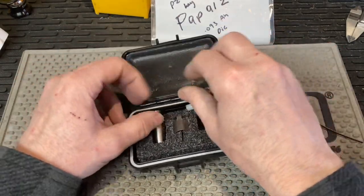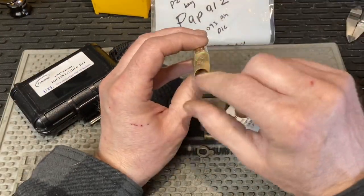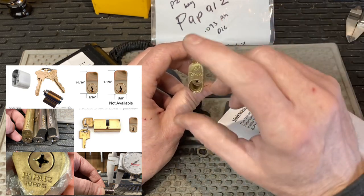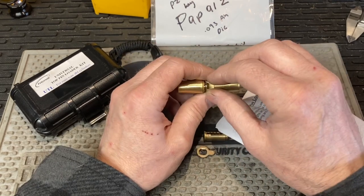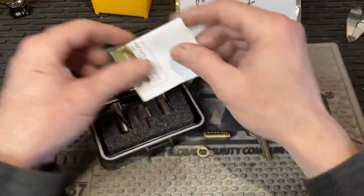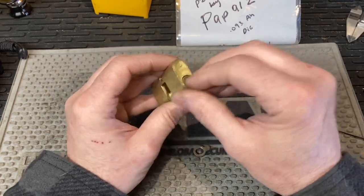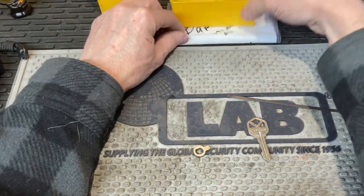Sometimes a customer will want to know if I can make their profile cylinder match their other locks. If it's this type here, probably not — just because of the sheer size of this will not fit into a profile cylinder. You can get profile cylinders in all kinds of different keyways. Lowe's seemed like they had profile cylinders in Quickset keyway, and Home Depot had them in the Schlage keyway — the SC1 keyway. So you can mix and match and find a way to make them work that way. Anyways, that's what I wound up having to do — I'm just going to put it all in my bag and save it for a rainy day.